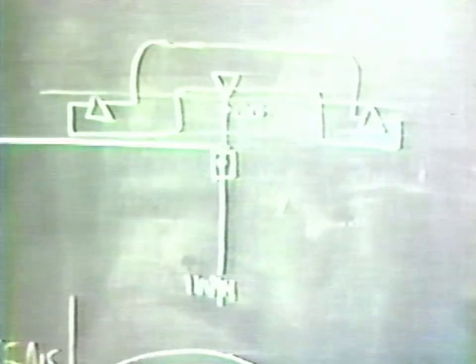In the HCE series, the CG is put rather low. That is, it has a relatively low mechanical sensitivity. And then by magnifying the displacement of the beam, we bring the sensitivity back up to the value that is required. Two things are accomplished by this. First of all, the period of oscillation, that is the time that it takes the beam to oscillate around its equilibrium position, is greatly shortened, and the time required to make a measurement is thereby shortened.